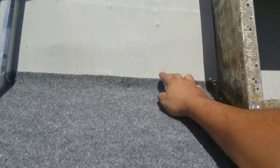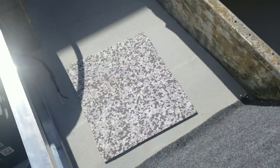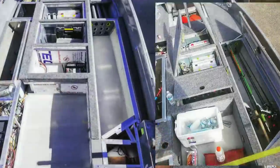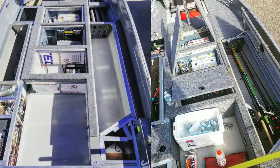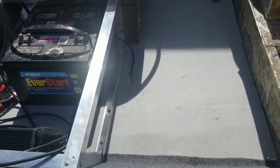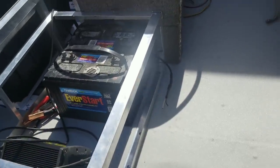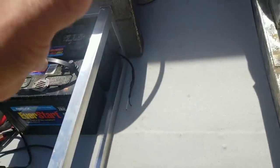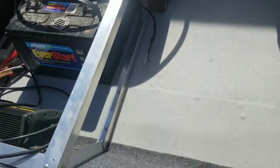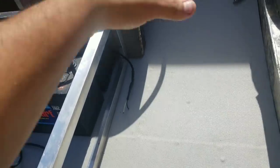You're going to put an aluminum subfloor in and then carpet it — no, that's just going to be a pain. Or if you put a cheap product like C-Deck, it's also going to result in the same problems. If you're going to put Gator Skin on a wood subfloor like I did with my Smoker Craft — which came out massively successful and I love it — make sure you put the right type of stuff on it. Make sure you resin coat that wood so it's more or less bulletproof, because this stuff will likely outlast the wood, and you don't want to be in a situation where the covering outlasts the wood subfloor itself. If you're going to do a wooden subfloor, preserve it the correct way so the Gator Skin and the wood can actually last together. Water goes right through carpet into the wood, but with this, no water gets through it at all — except for a drain port, which we still need to make.